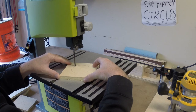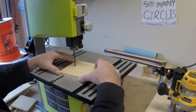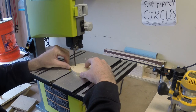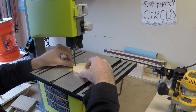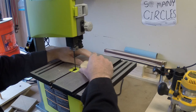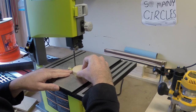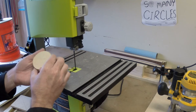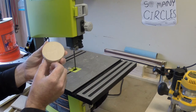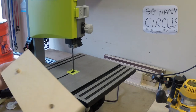A bandsaw can cut circles, shapes, sharp curves, and even fine details. When cutting a circle freehand, I like to take off major sections of wood first and then nibble away until I get as close as possible to the finished circle. Another technique is to keep your focus on the center of the circle you're cutting, or place your thumb on the center as you rotate. The biggest disadvantage of the bandsaw is you can't cut a circle into wood without making an entry cut, but if you can hide that entry cut in your project, then have at it.